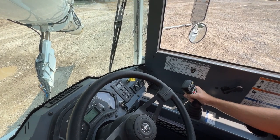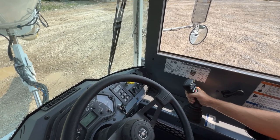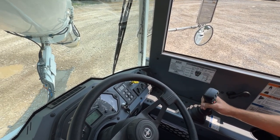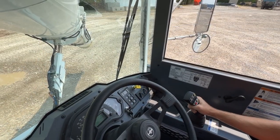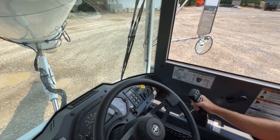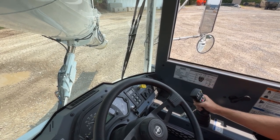The chute control on the S-Series joystick is set up per SAE best practice. Moving the joystick to the left rotates the chutes to the left. Moving the joystick to the right rotates the chutes to the right. Pushing forward on the joystick lowers the chutes, and pulling back on the joystick raises the chutes. The chute speeds are preset within the software on the truck and utilize a multi-ramp control setup. This allows for controlled, minute movements for a majority of the joystick throw, while also allowing for rapid movements when the joystick is commanded to its maximum position.